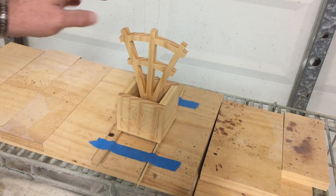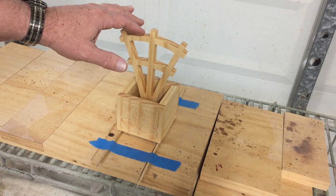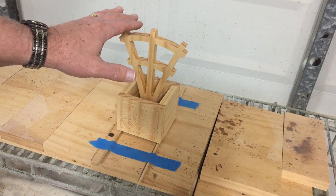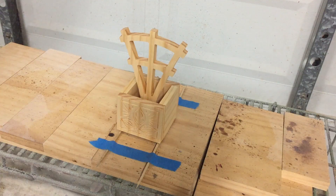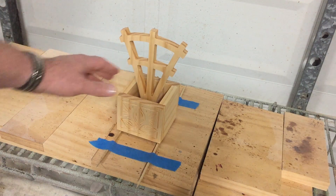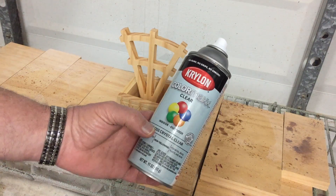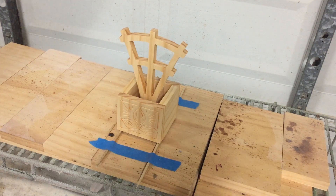I went ahead and put two coats of the 50/50 denatured alcohol and seal coat, then sanded lightly with 400 grit sandpaper overall. Looking at it, I think I like it natural — I'm going to leave it natural, so I'm just going to put the final clear coats on. I'll put a few very light coats of Krylon gloss, and then the very final coat I'll follow up with a Krylon satin finish just to take some of that shine off.